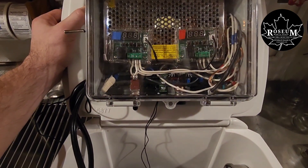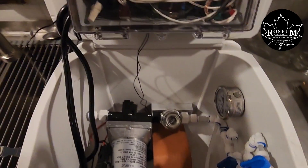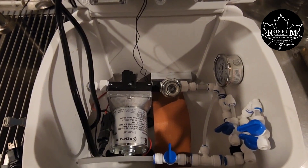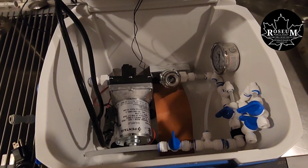The temperature controller is going to keep it all to about 38 degrees in here so you don't have the pump freeze up, and the pump would run a little bit below freezing temperatures just to make sure everything kind of gets pulled dry as well.